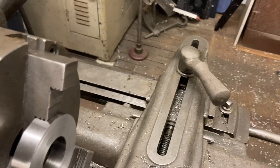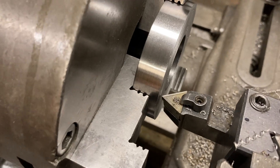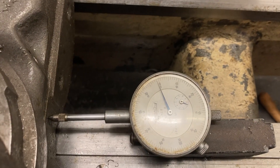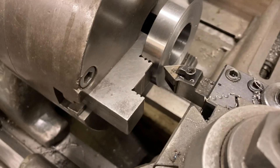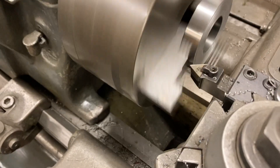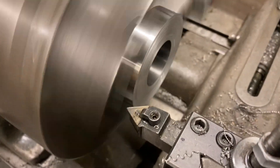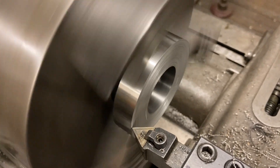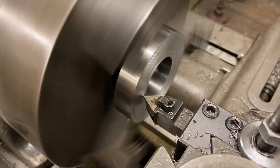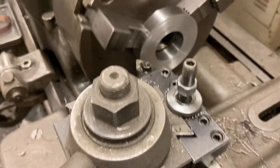I can semi-finish face them in this lathe while the mill is running doing the cutting. I put them in there like that, bring this tool in right here, touch off on the part. I'll bump the part right there just with the tool, bring my indicator up, touch the carriage, zero it out. And then I've got to take 25 thou off. We'll back up right here, turn this guy on — boom — move in: 10, 20. Come over here, face it. I already took it off so I'm cutting here just to show you. We'll come across, face that off, come back, finish pass — 5 thousandths. And then I still got 5 or 6 on.